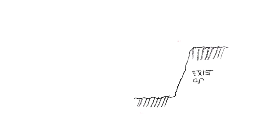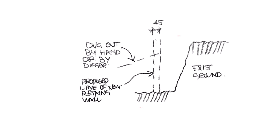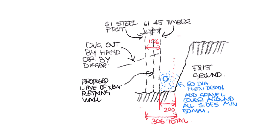In order for our drain to work with the hydrostatic pressure it needs good percolation around it, and we achieve that by surrounding our drain in gravel — at least 50 to 100 millimetres around all sides. I want to use slightly rounded 20 millimetre stones to create gaps between each individual stone, which creates the percolation we're looking for. So our dimensions call for an additional 200 millimetres of dig beyond the wall face. The other materials we need are some landscape fabrics, which won't affect our dimensions — we'll get to those in a minute.